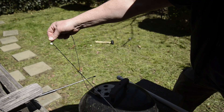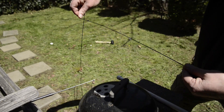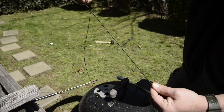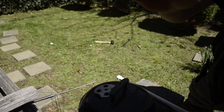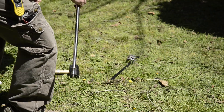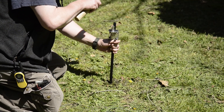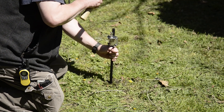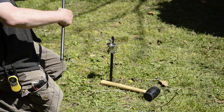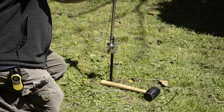I got this great idea from Michael KB9VBR — one of his videos where his buddy Dave KZ9V showed this genius idea of tying a string to the top of the telescoping whip and then measuring down: 6 meters, 10 meters, 12 meters, 15 meters, all the way down to 20 meters. So you don't have to take a measuring stick out every single time. You just raise the antenna and feel for the knots as they go by, and that tells you which band you're in. This time we're going to start off with 20 meters and see what it looks like on 10, because I have checked the other bands and it does just fine, but I haven't tried to transmit yet — so that's what this is.